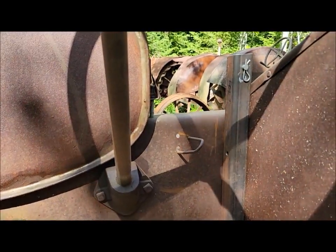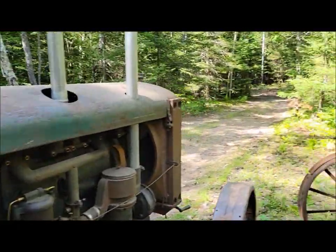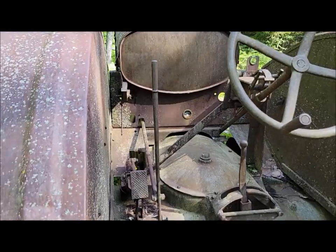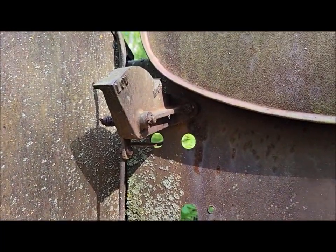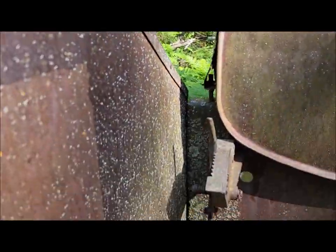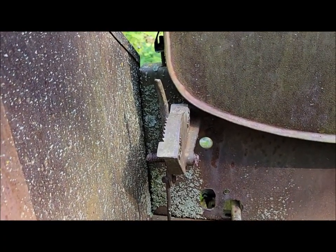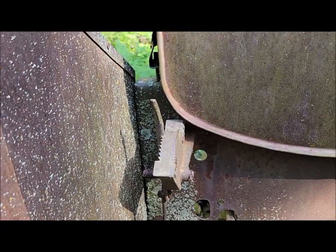And this one has the linkage holes for the tickler valve on the carburetor, where I believe the later ones, you see this 27 is the same. These ones have been so cobbled up that I don't even want to show you to compare, but this started out life as a short fender firewall. It's been hacked up, but see all the holes are different underneath there because the throttle quadrant is different. So this would be more of the quadrant that Jesse should probably have. It just has the single control because you'd probably have a mag that has no advance and retard features on it, the automatic controls. So all you need is the throttle control on the side there.